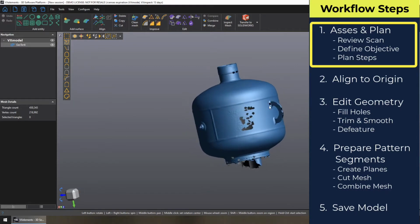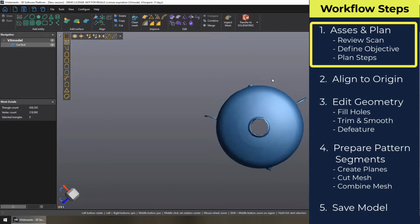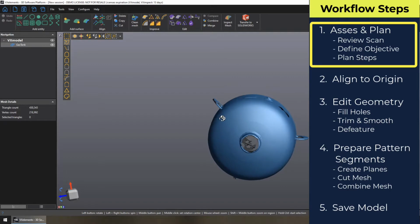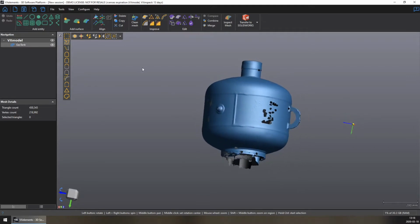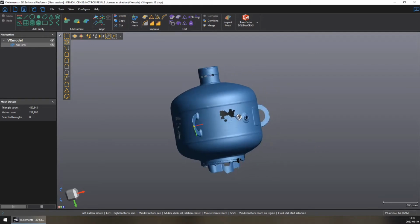And then what we'll do is we'll do this as a two-piece cover. One piece will fit up here, and then another piece will fit down here. That way we have full coverage around the brackets. So your own design may vary. You may do this as a single piece, a two-piece, or multi-piece. It really doesn't matter. The purpose of this video is primarily to show you how to take scan data such as this. We're going to show you how to use VX Elements, specifically VX Model, to prepare to fill in these holes, to prepare the model, and bring it into Rhino ultimately for use with ExactFlat to produce flat patterns.